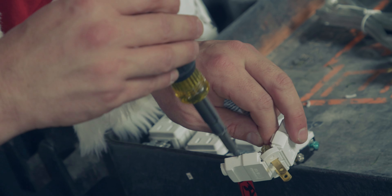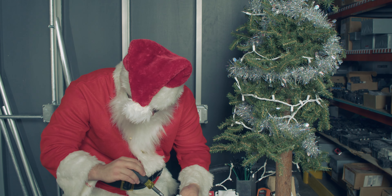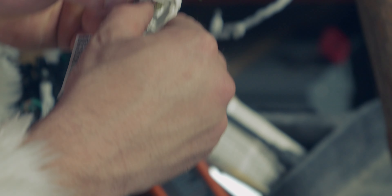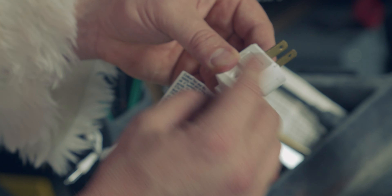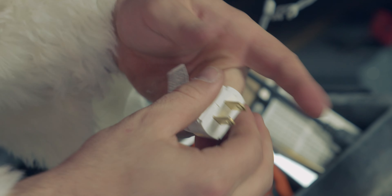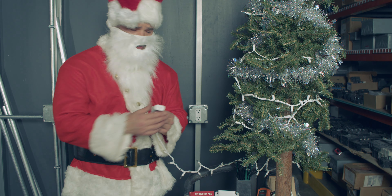Sorry guys, it's been a long night — hands are cold, been climbing down chimneys, running from dogs. You guys on Christmas Eve, put your dogs in the kennel. The hot is landed and the neutral is landing good and tight. See this hole right here, Brett? You don't want to put the wire over that hole — that's for the screw that's going to go down and hold it tight. We then tighten it up, give her a little tug — seems all good!